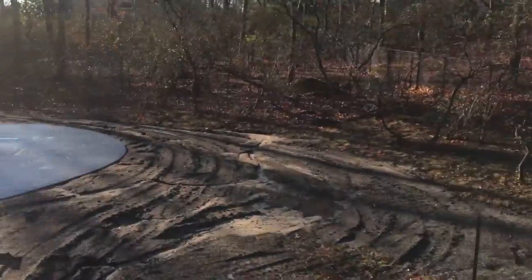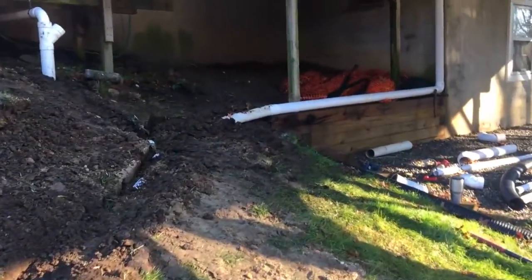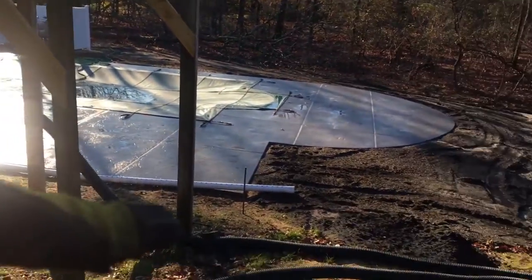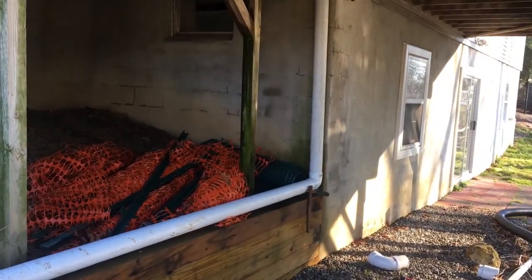Back here at the Apple Ridge job in Wall Township, tidying up the drainage. We've got a Y with the clean out down, connects with this other one that used to go over, down, and out. And this one here used to come up through here, then out with the black pipe. So we just cleaned it all, put it in on the ground, secured it in place.